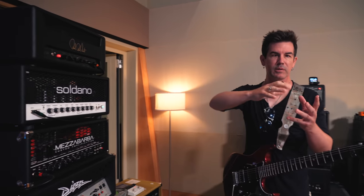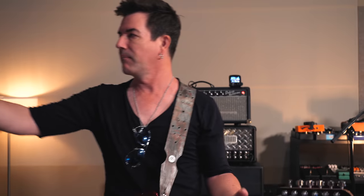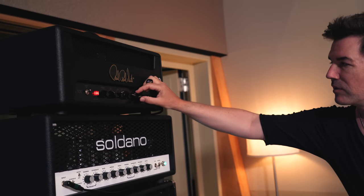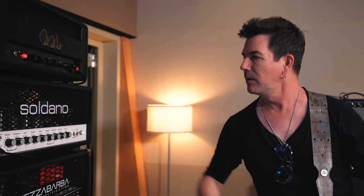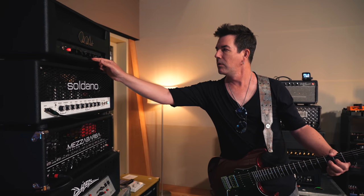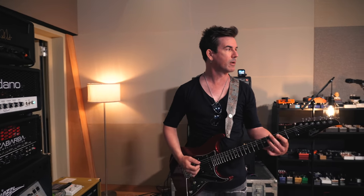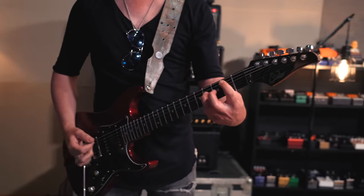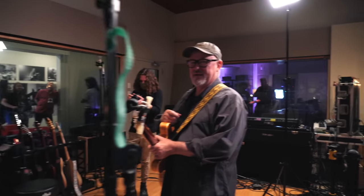Because all you're doing at that point is letting more and more through the pot of the lower frequencies as you're turning it up. Down here, the high frequencies are getting bypassed completely. But a lot of the magic Marshall thing is when that's, it's a 4700 pF bright cap probably. A bit of a one-trick pony, but it's a great trick at that point. It's the one-trick pony that I love the most.